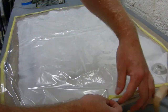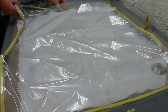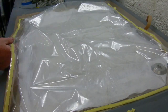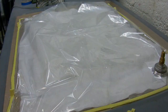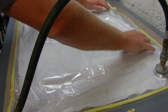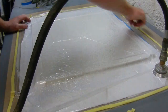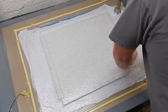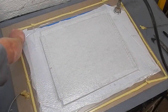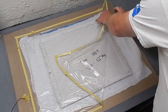Here I've put the seal and tape on the bag, which is something I like to do — it makes it easy. I'm trying to make sure I don't have any resin sloppiness underneath the tape, because that'll definitely set you back. I'm going to suck it down with not much vacuum, probably half or so — it was 12 inches of mercury. And let it cure overnight. I set the table at about 78°F and 12 inches of mercury, which I wrote on the bag so that I would remember.